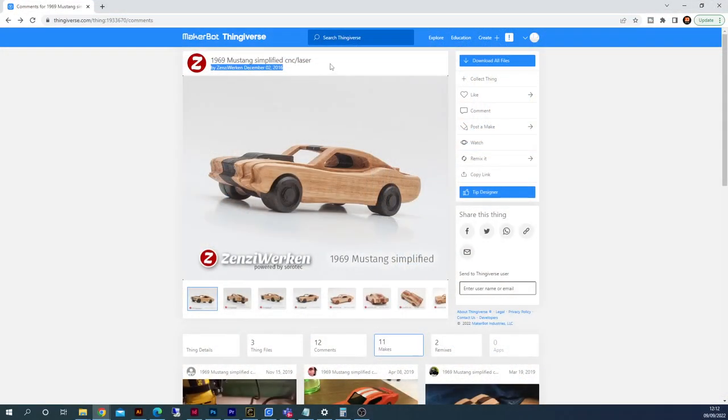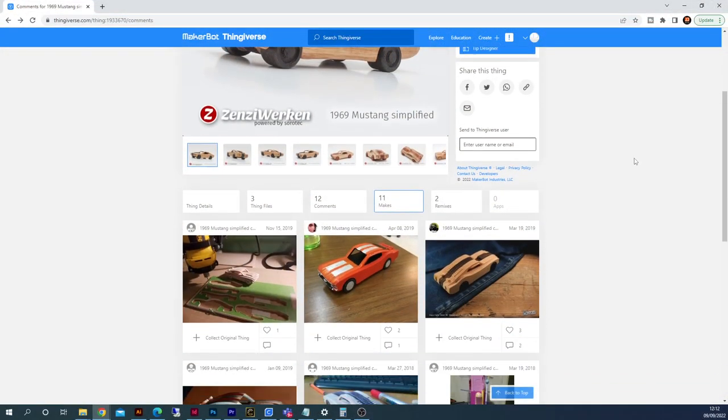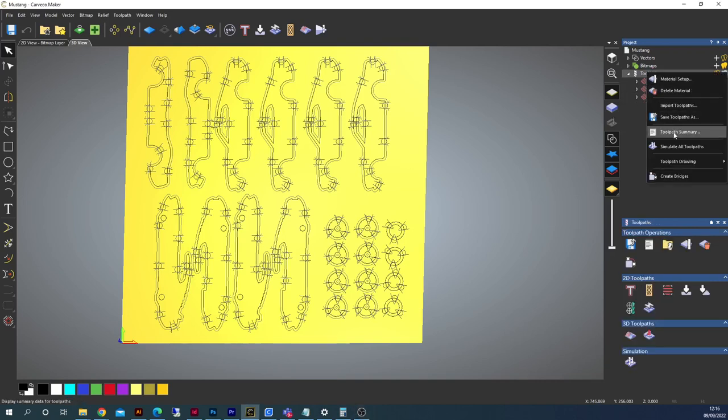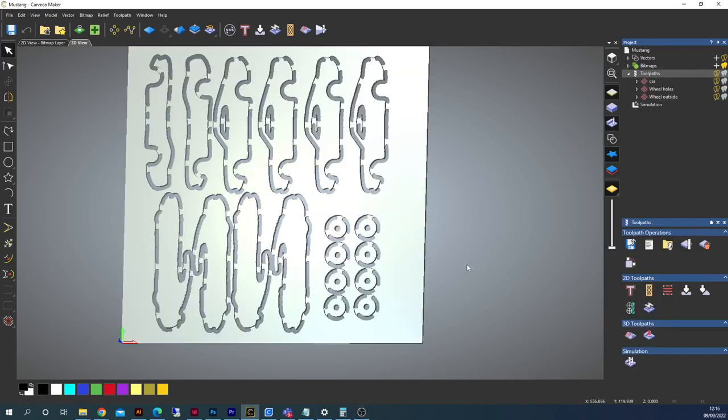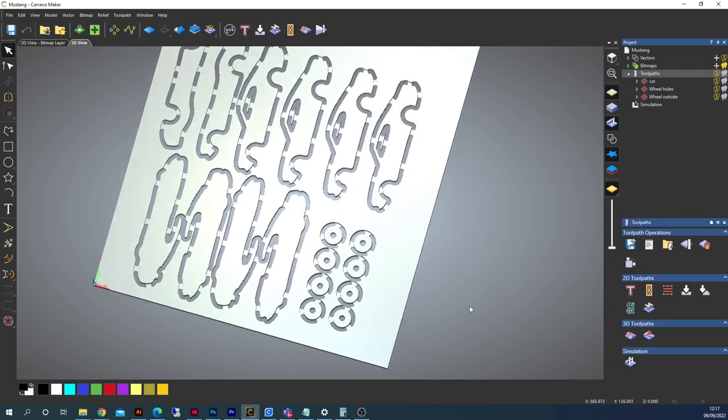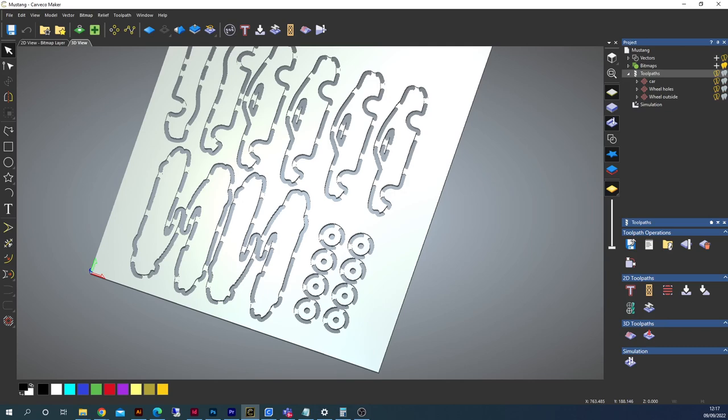I then moved on to a project. I headed to Thingiverse, downloaded a file from there. I will put the link to the file in the description area below. I then dropped it into Carveco, did all the relevant tool path work to get the output GRBL files I required to get this cut.